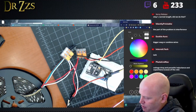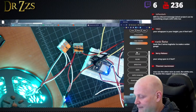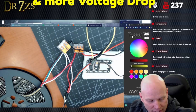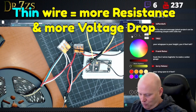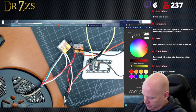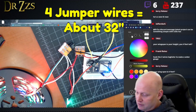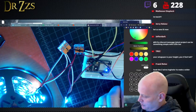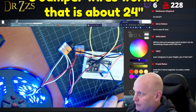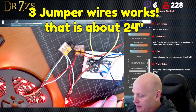I'm going to try it at four feet now — much shorter. Same problem, still doing the same thing. This is half the length that it was before. So four feet is too much. Using thin wires is probably a little worse, because if I use these thin little jumper wires that'll be even more resistant, so the voltage will drop even more. I have four jumper wires chained together. Let's just shorten this — take one of these out. Okay, now it seems to be working. I've found a length that is okay.